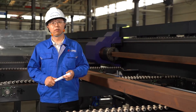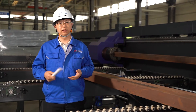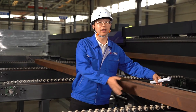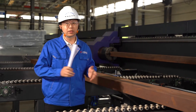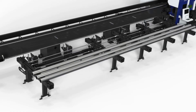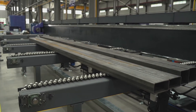I've introduced the pipe cutting machine processing features. Now I'll introduce some features of the feeding machine. You can see there are two pipes on the loading machine now, tightly stuck together. The feature of our feeding machine is complete flat-bed feeding — a bundle of pipes can be directly unpacked onto the loading chain as long as they are flat and together, with no need to lift them to a specific station.